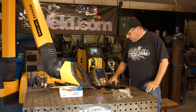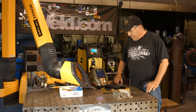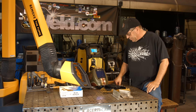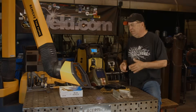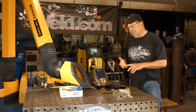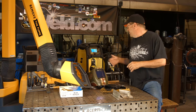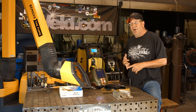When I was mocking this up, I read the technical specs, and I'm running off of an ESAB Rebel 235. I went through a bunch of different settings. This is a little odd to me — I guess I'm stuck on the carbon steel wires and the DCEN and how you can get that good tight sizzle, but this one's a little bit different. I'm running DCEP. I'm going to do a volt range of 28 and I'm doing 465 on my wire feed speed, .035.